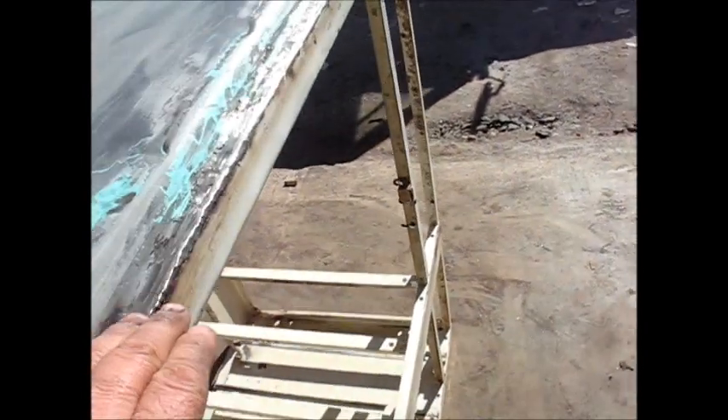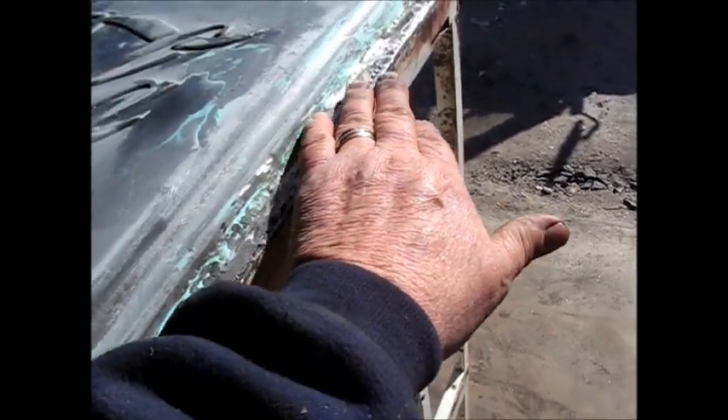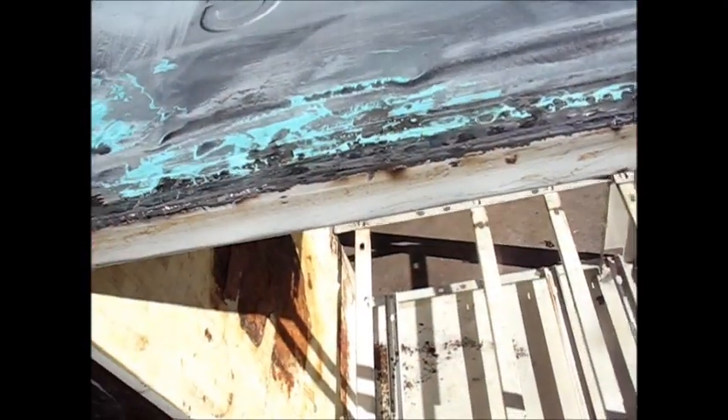I got her mounted on here. I did those flush welds here. I had a hard time getting them to stick over here, so I wound up just doing a little tacking up along the edge also, which got it on there good and firm, and I think I'm going to try a little body filler in that and right here where I had a rough place.